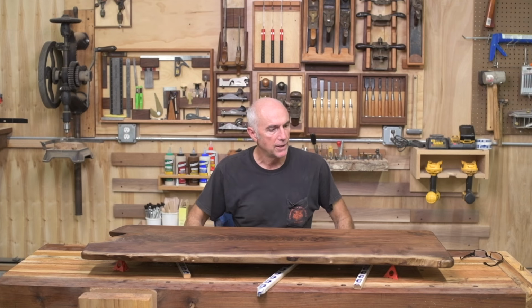But you put the Rubio on, wait 15 minutes, then you just wipe it off. I will leave it at that, and then tomorrow I'll start thinking about legs.